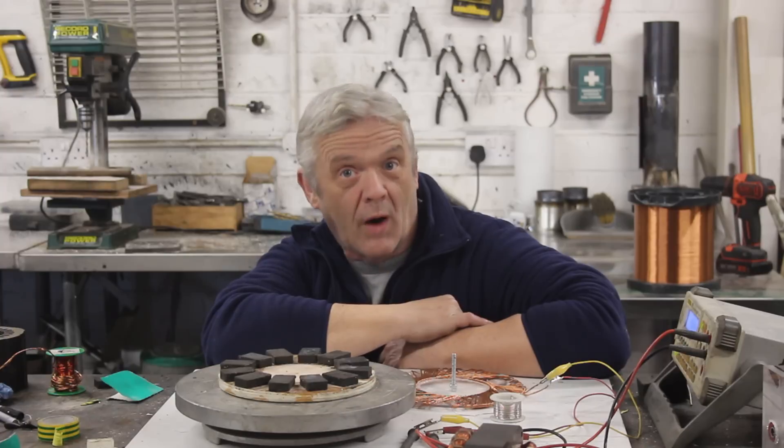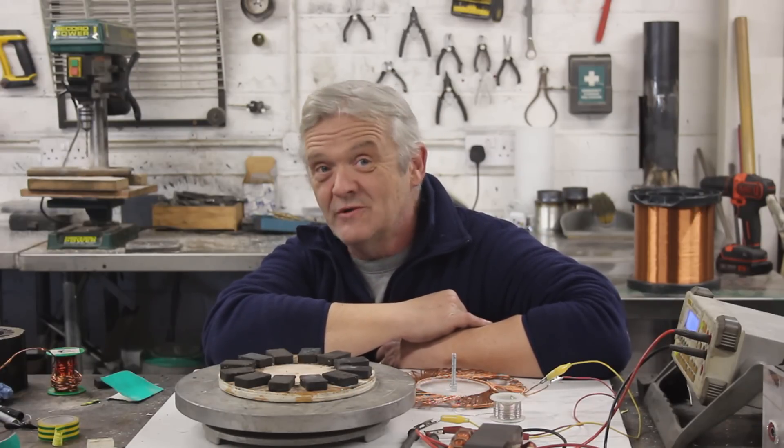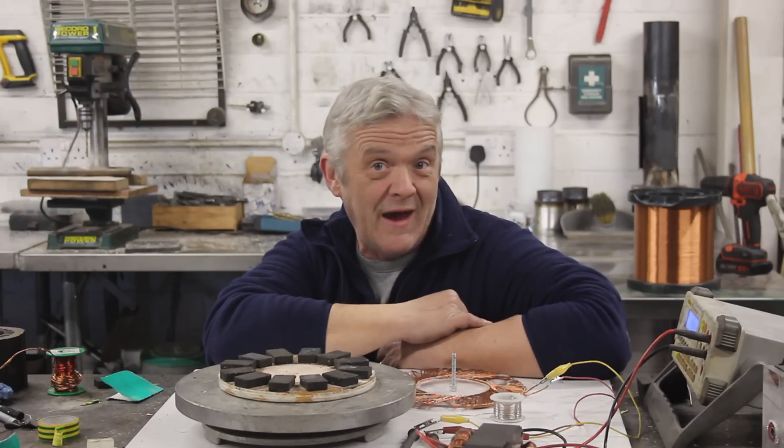It must be Litz wire because you have to have the strands separated — otherwise, if you use standard stranded wire, you might as well use a copper pipe because you're effectively winding only one wire. With Litz wire you're effectively winding 50 in one go, then connecting them in parallel to get an improvement in amperage as opposed to voltage, which is what you'd get winding them individually. So you can make a choice: spend the time winding those 50 coils individually and get a super high voltage out, or use Litz wire, join them in parallel very quickly, and get much more amperage capability.